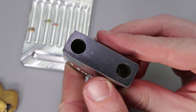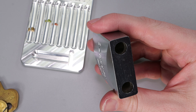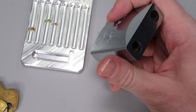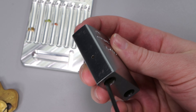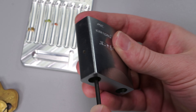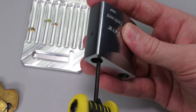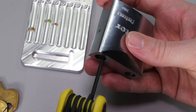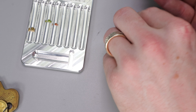Let's try to put our Master Lock Pro Series 7050 back together. It's got the actuator kind of free-floating, and because of that the ball bearings have dropped out and the shackle has come off. But the first thing I believe we need to do is get the locking nut out, and this is going to be a 7/64ths. I don't take these locks apart to this degree very often, so this is probably not going to go super smoothly, but I do remember the basic steps, so hopefully we'll be able to do it together right now.